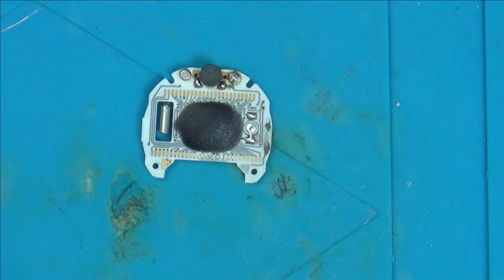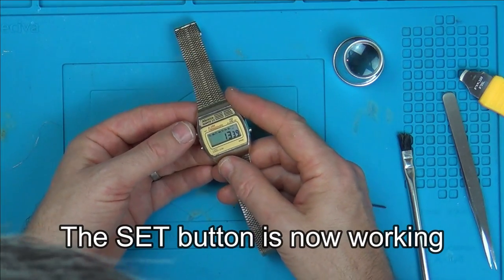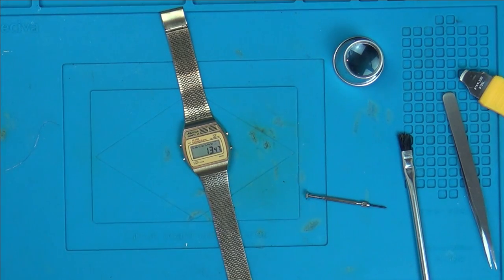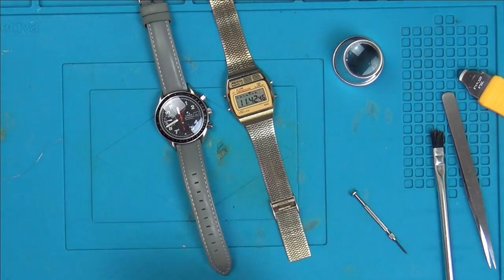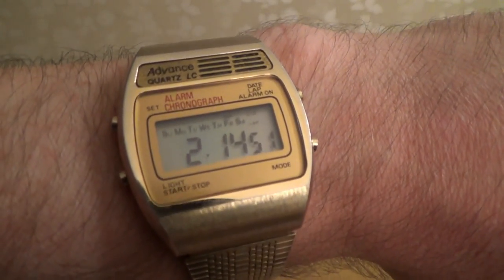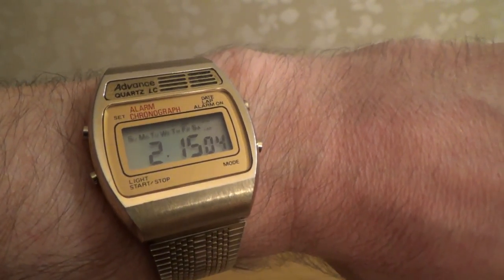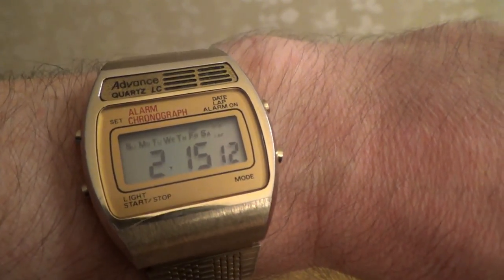Let's put it back together and see what it does. It's nearly done. Watch this — you'll see it be nice and bright and then a few seconds later it will go dim. And back bright again. So it's been about two hours later now and I managed to get rid of the fading by just taking it apart again and moving the enamel wire away from the transistor. I'm not sure if it was shorting against one of the legs or causing interference, or it could be complete coincidence. But for the last couple of hours it hasn't faded in and out at all — that's definitely fixed.